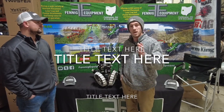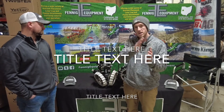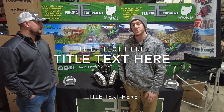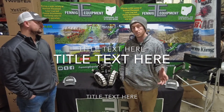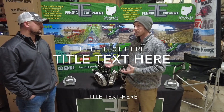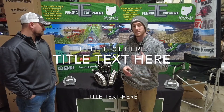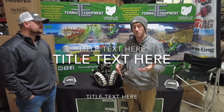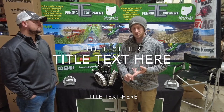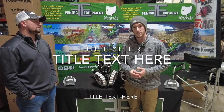We typically use the precision clean sweep controller in the cab — it's the dial that's going to lift and adjust these row cleaners right where we want them. If you guys are in the market for row cleaners, or if you have no-till coulters on your planter today, we highly suggest getting rid of the no-till coulter and putting a row cleaner in front. We've seen huge advantages: less down pressure, no hair pinning, better seed-to-soil contact, and a smoother ride — all of which adds up to better yield in the end.